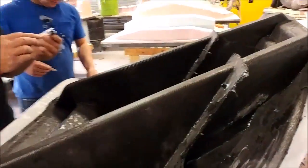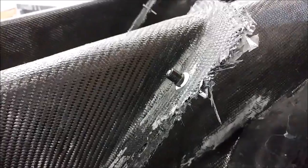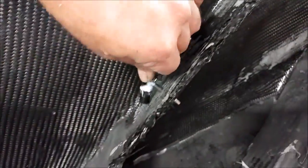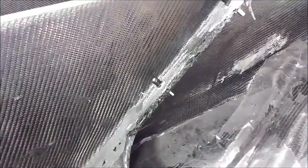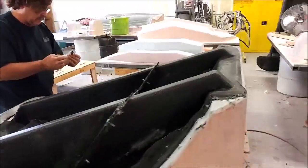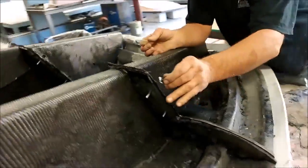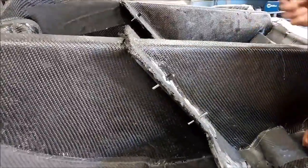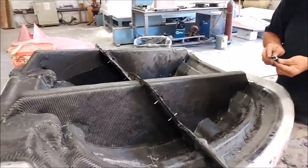Here's the first of those door frames with the new braces and flanges. Jeff's drilled some holes and is putting bushings into place - you can see he's got the pins through the holes and is bonding the bushings in, one on either side. Then it gets carbon fiber put over the top to securely bond it. Those holes are used for aligning the two halves of the mold before it's laid up, similar to what we've done on other two-piece molds.